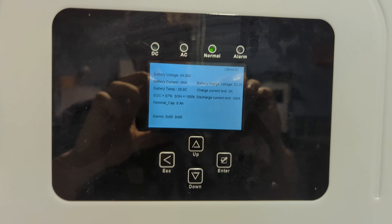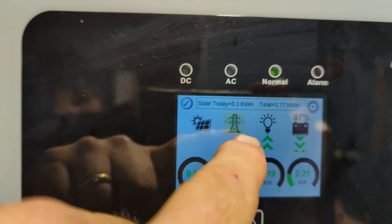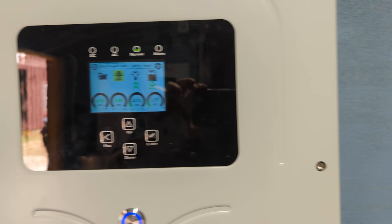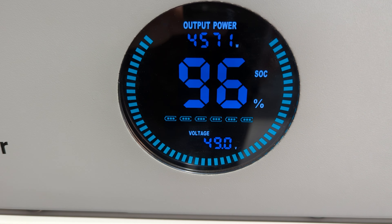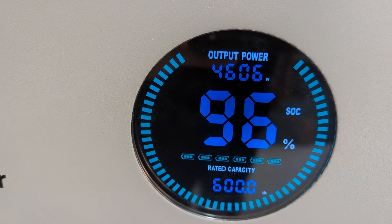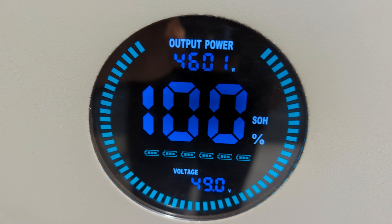We're closed loop and running my house right now. I turned the grid off, turned the solar off, and we're seeing about 2.25 kilowatts on one unit and about 2 on the other — running 4.5 kilowatts total off the battery. The battery display looks good and shows state of health, state of charge, voltages, and a flashing indicator for how much it's discharging.